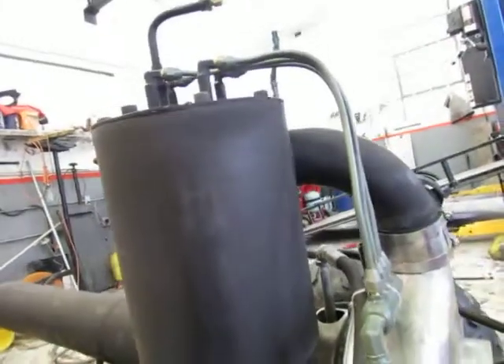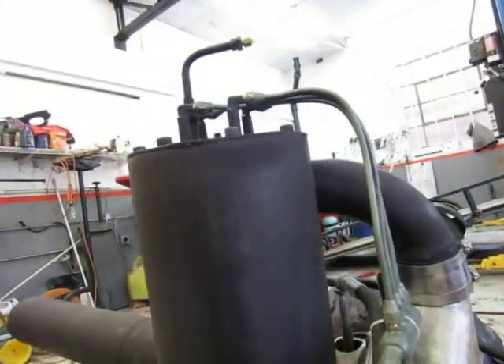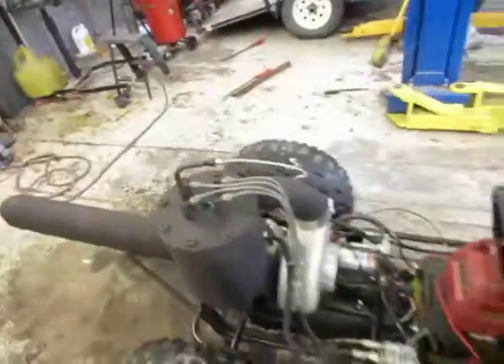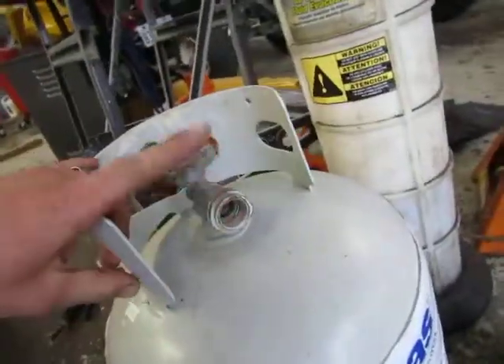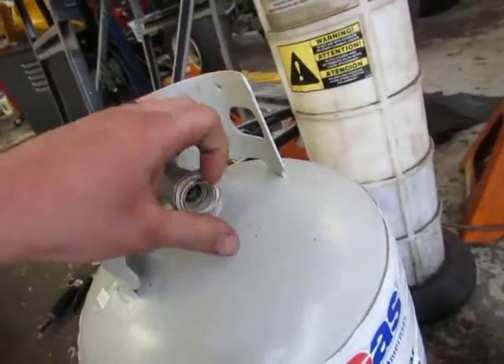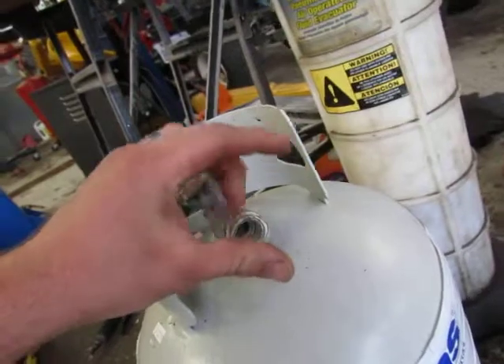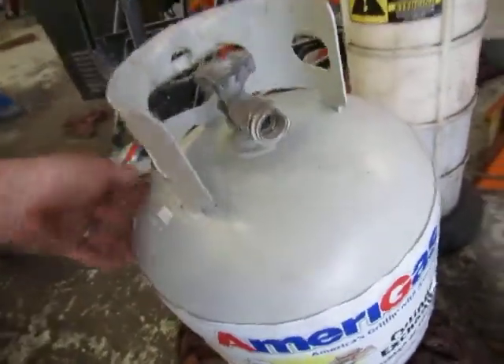And that's how I made it. One thing I did notice — with propane, you don't get the full power. You've got to worry about the tanks cooling down a lot and everything else. One thing I did to help with your tanks cooling down too fast: make sure every pipe fitting you have is as big as possible. Like the fitting that goes into the propane tanks, you can screw it in and out, take a look at it and see if you can drill it out any bigger. That'll help with your propane flow and it'll help to keep your tank from getting cold too fast.